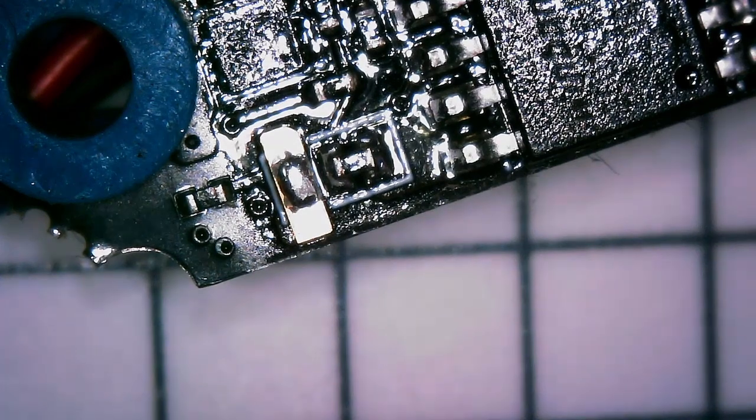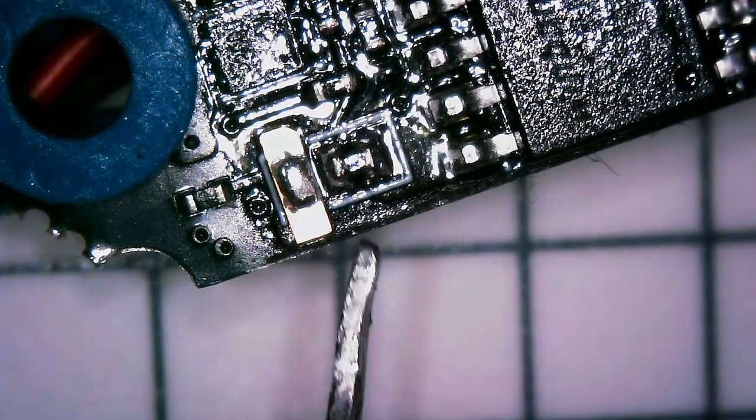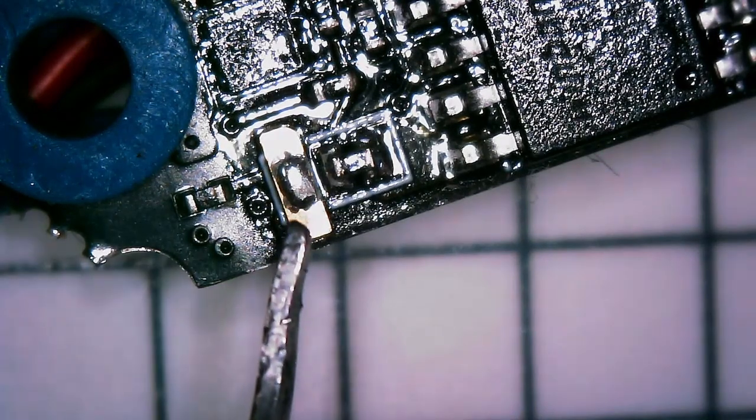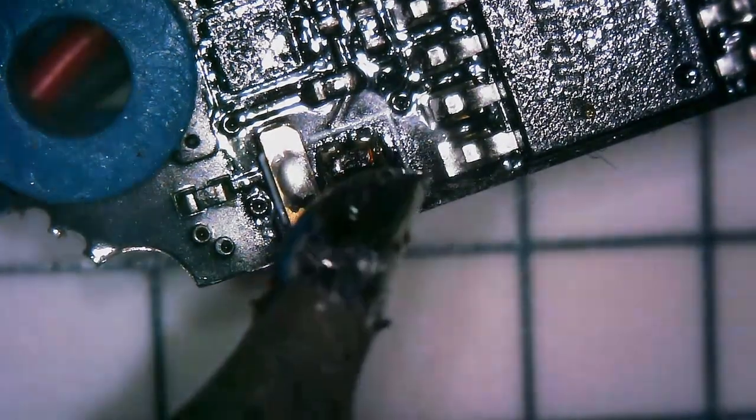This is Mike Chen, and I'm going to show you today how to set up the hard pit switch on the F7 flight controller. On the back side of the flight controller, there's a resistor that is currently bridging the VTX switch and the 3V3 pad, and then there is the RX5 pad right next to it.